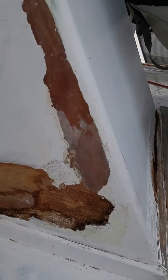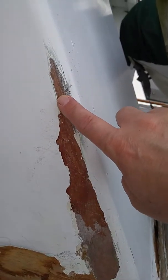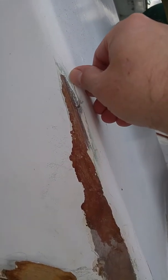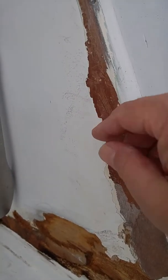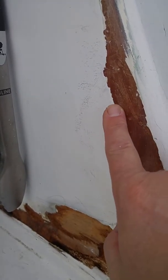After some digging here, it looks like we had a little bit more damage than we first thought. And this is the trail of damage. So it started here, where I've sanded the crack down, and then I left this little tiny piece right there where you can see the water flowed down there. What it does is the bare wood absorbs the moisture — what little bit of moisture comes through that crack — and it starts to dig its way in between the layers of paint.